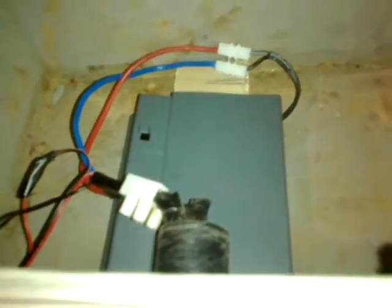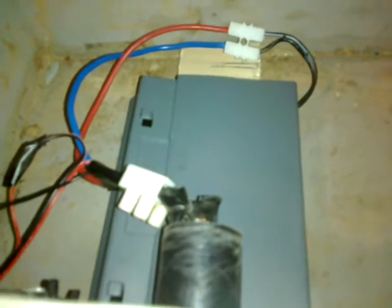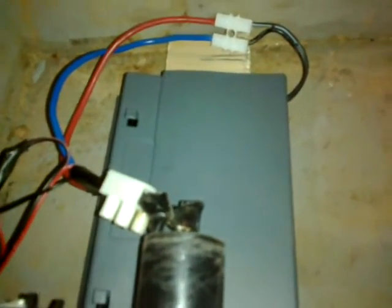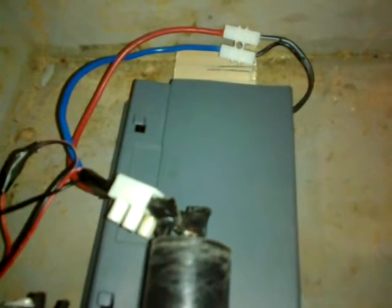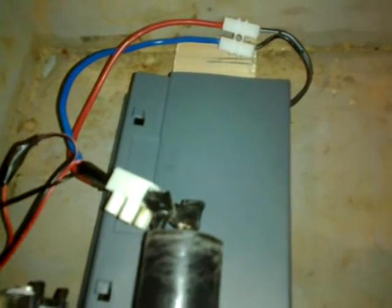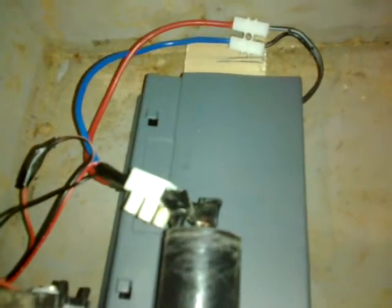They're only 800 milliamps. As you can see, the box is second hand — half of it's makeup residue, the other half is sawdust from drilling the holes. So yeah, I've lost a lot of weight and a lot of power. But the 1.5 watt solar panel would take a whole day of good sunlight to charge up the big battery, whereas it obviously charges up these 800 milliamp batteries a lot quicker. I've got 2,800 milliamp batteries — big heavy ones — but I keep them for high-powered devices like handheld radios, otherwise they go flat when you transmit in no time at all.